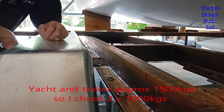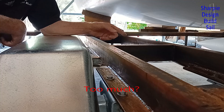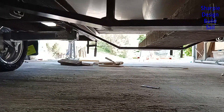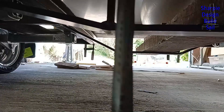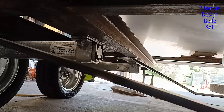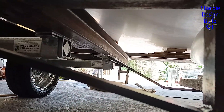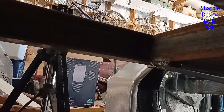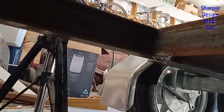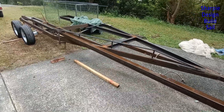It's roughly 17 millimeters — the boat's moved down nearly three-quarters of an inch. That means the trailer is going to be quite stiff for this boat, but it also means I've got more road clearance in the center. I designed the road clearance of this cradle to be six inches or 150 millimeters, but it's 210 millimeters now. So I think if I put something solid through between the arms at the back and maybe put some rails on top of the outside rails, that'll stiffen it up well enough.